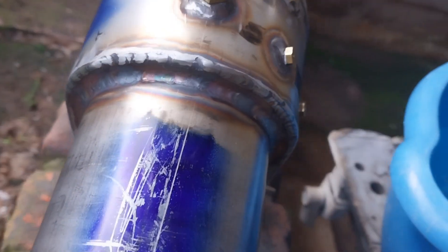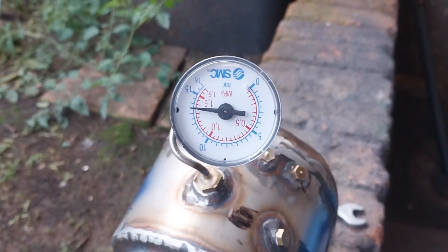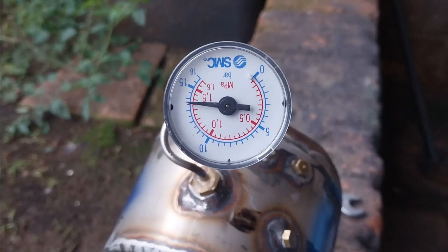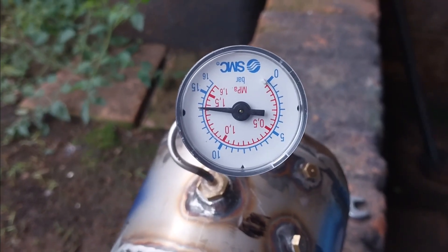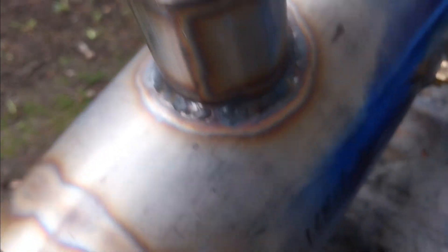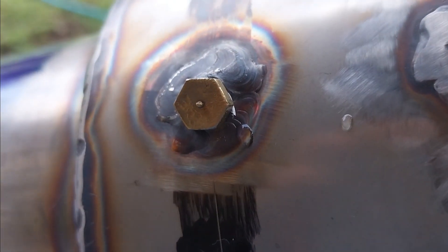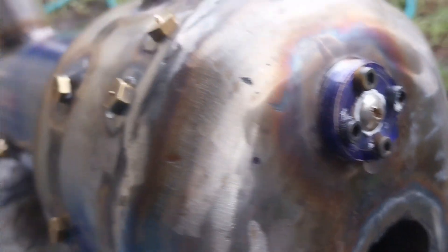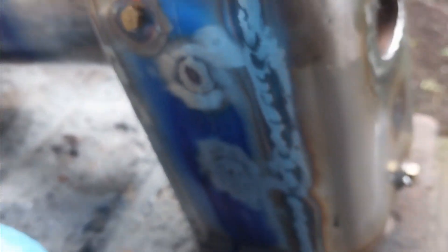For the next half an hour, I'm going to pump that up to above 14 and a half bar and let it sit for another half an hour. So it's been an hour and it's just below 14 bar. We still have those little leaks on that head there, but all the welds look fantastic — so there's no concern there. Some of the fittings have a little drop on, but that's not a biggie. And I see that this back fitting is leaking a little bit. But structurally, this boiler is fantastic and it's ready to go to the next stage.